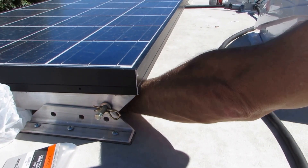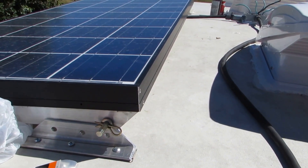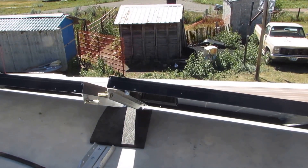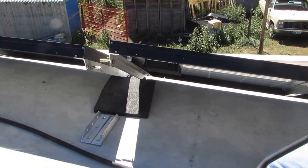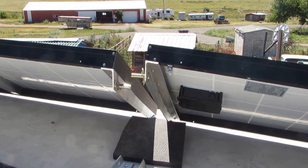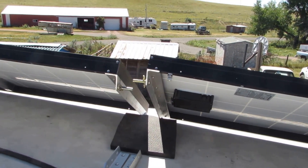I've seen some that were extremely hot because the airflow couldn't get under them. The air under here stays nice and cool all the way down to the ground. When panels get too hot, they actually de-rate themselves and don't produce enough electricity. I was reading about that, and it told me I needed to step them off the roof a little bit for airflow.